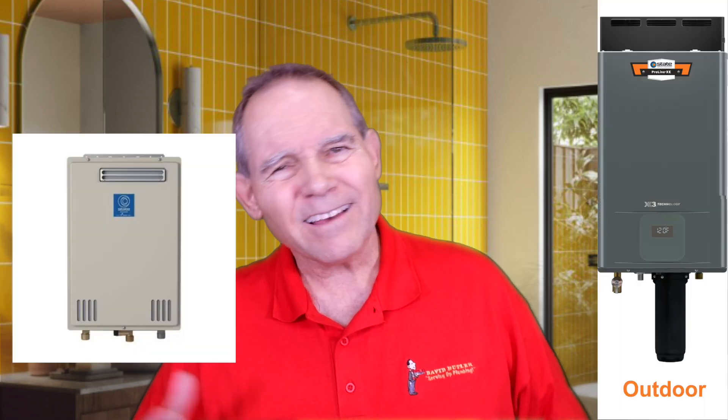The majority of houses being built nowadays with tankless, at least in the North Texas area, are outdoor tankless. I'm kind of on the fence about this. North Texas still gets really, really cold — sometimes into the single digits. Outdoor tankless can be tough to keep from freezing. And if the power goes out, you're in real big trouble. Most outdoor tankless are not as high efficiency as some indoor tankless because they are non-condensing units — the vent goes right outside through the cabinet in the wall.